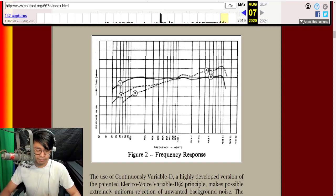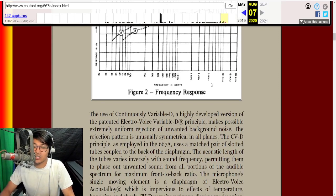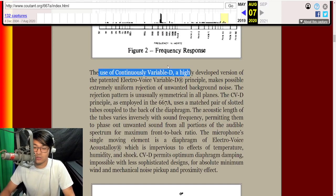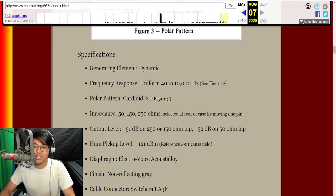For A and B: A is basically a presence boost — if you want that presence and brightness on the microphone you can do so — or you can keep it flat with B to make it sound a little dark. What's cool about this dark, warm feel when the whole microphone is flat is that it is a lot more closer to the RE20. And as you can see, the Variable-D technology is not a new thing — it's been here for decades. There's the polar pattern and a few things about the frequency response — in terms of its excitement, it can't really excite anything beyond 10 kHz.